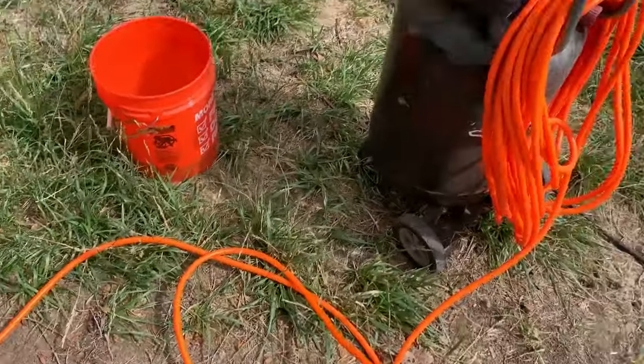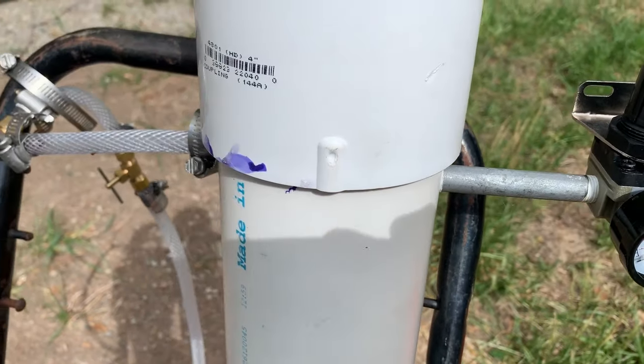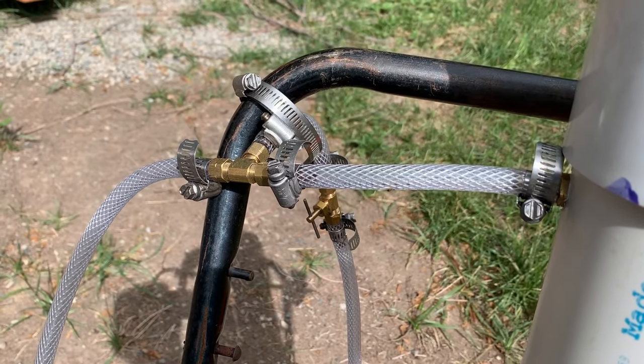A nipple to accept the air hose from the compressor. Pressure regulator through a quarter-inch pipe nipple into the chamber that will house all the foaming agent. Air pressure continues on to that T-valve there, which is actually an eductor. Soap solution is forced out of the bottom and then drawn into the airstream by virtue of the fact that the aperture on the air inlet is drilled down to a sixteenth of an inch, and the flow from the inlet is a quarter-inch and the flow out is a quarter-inch — so it should pull the solution in, run it down the long hose to the mixer. And in this chamber I have expanded stainless steel wool that will agitate the foaming solution, and foam should come out of here.